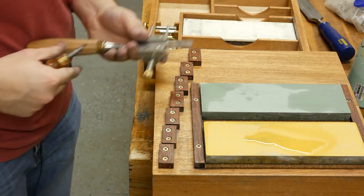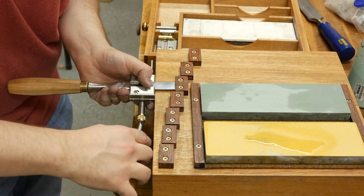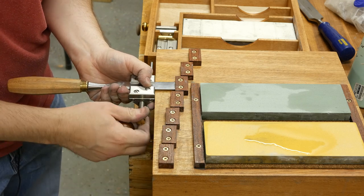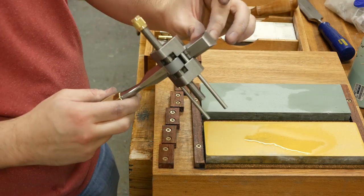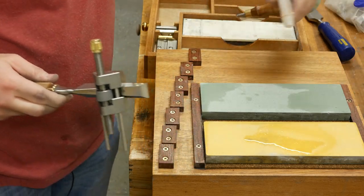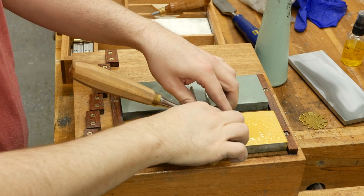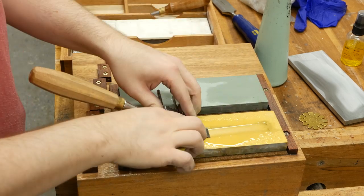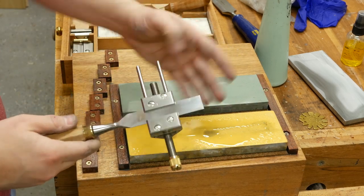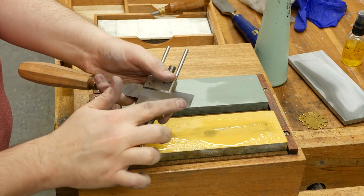I've got this set to 30 degrees — placed on the 30 degree stop, tighten by hand, then tighten with a screwdriver. Since the micro bevel on the very end is so super tiny, this is not going to take any time at all to sharpen. I'll do it live! I'm going to place it on the 1000 grit stone. Six passes — feel the back — I've already got a burr. That's an indicator that you've pushed the steel over and you're ready to move on.